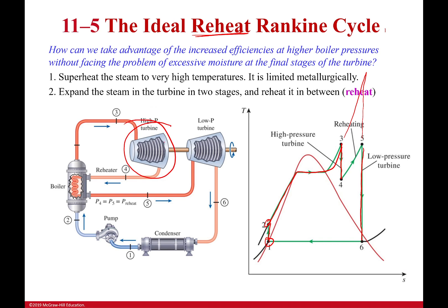Once you go out of the turbine, you are expanding and your pressure is dropping — you're on a lower pressure line. If you were to continue all the way down to remove as much energy as possible at that stage, your quality would be abysmal. So the high-pressure turbine does what it can, then we pump this still-superheated vapor back into the boiler. We take this hotter but lower-pressure vapor all the way back to a low-pressure turbine. We've heated it back up to the maximum temperature, put it in the low-pressure turbine, and take the rest of the energy. There's a gain in energy, and also in complexity, but we do gain efficiency by doing this.